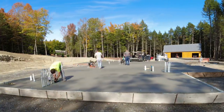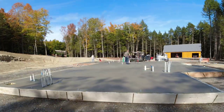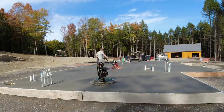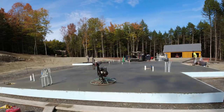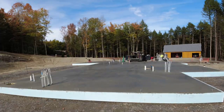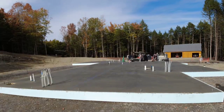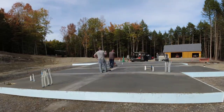Darren got it hit a couple of times and then it started drying really fast, so Luke pulled out the other power trowel and we were pretty much non-stop from the time we started. When we did get a break, we started stripping the forms right off — the styrofoam stayed right on the edges — and got everything all stripped and loaded. We're laying out the saw joints now, just to help control any cracks. We'll get this thing sawed and that's it. Let me know down in the comments: overkill or not? Thanks for watching — we'll see you on the next one.